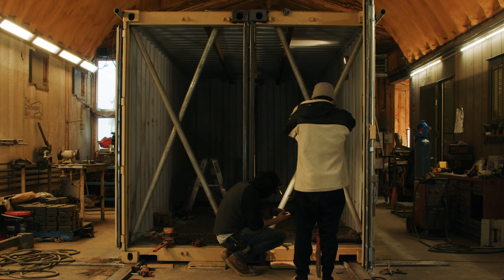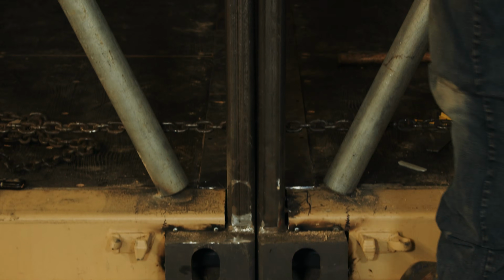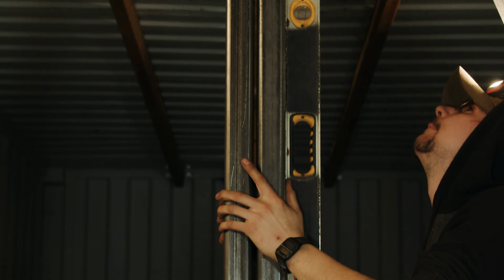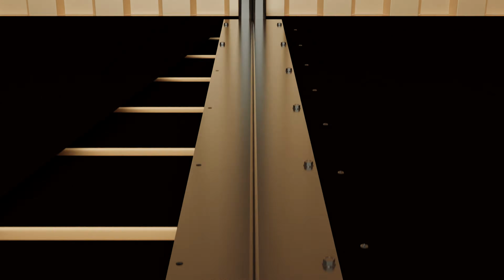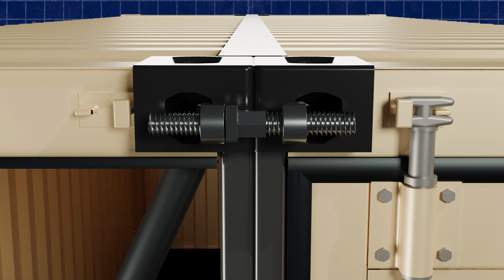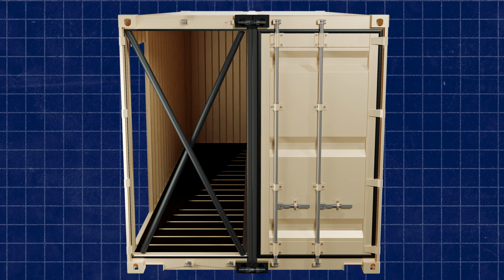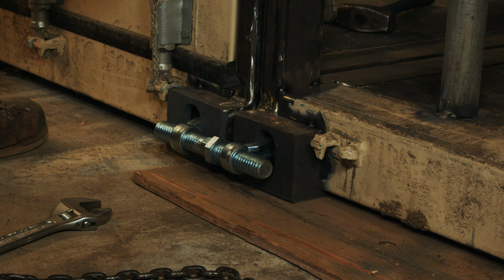The pin and dowel in the footer worked awesome for getting the two floor sections to auto align as the two halves came together. We have a drip cap for the header that gets the water to shed to either side, and these bolt style bridge fittings work great as a tool to bring the two halves together.